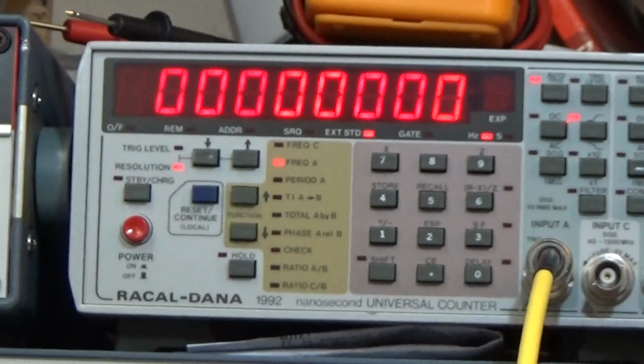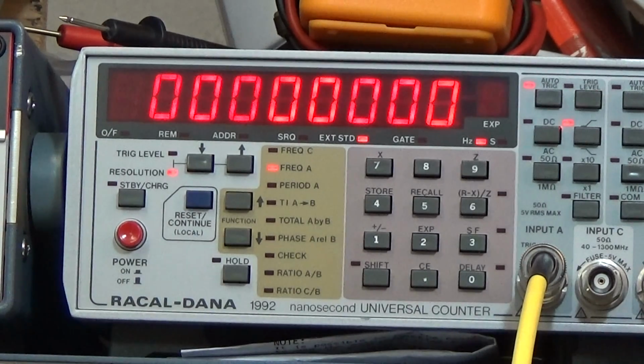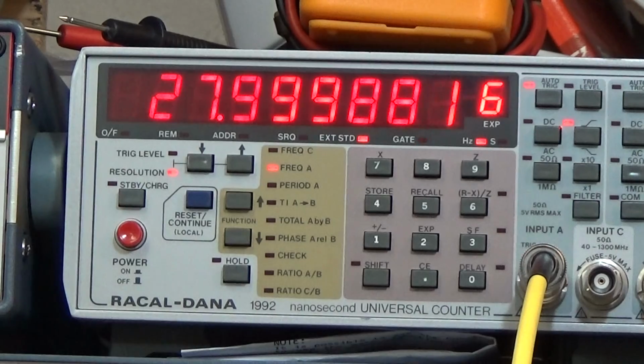The radio is set to, as I said, 28 megahertz, and I switch back to FM so that we have the continuous carrier, and let's see what we have. Okay, yeah, it is clear that he recognized some trouble on the radio bands. The frequency is 120 hertz off, and I stopped talking to see. For me it looks like the PLL circuit is locking, so we only have the last digit jumping, which is more or less okay, so no problem.